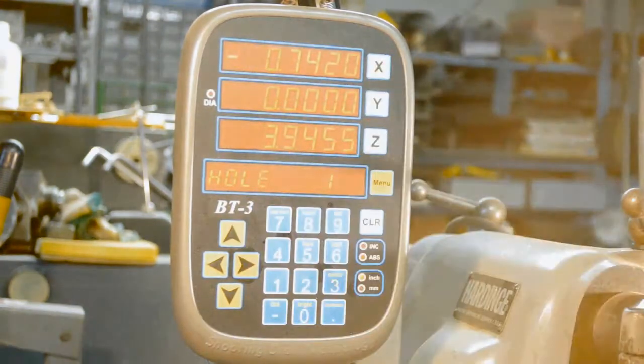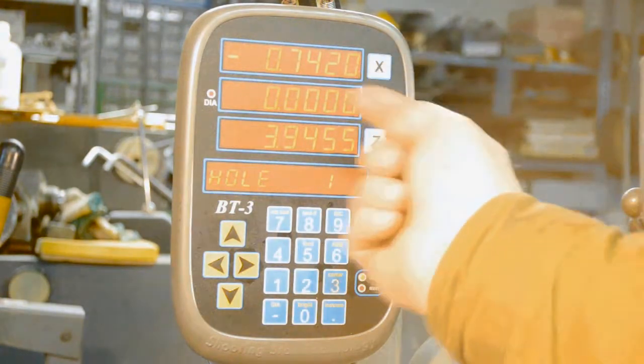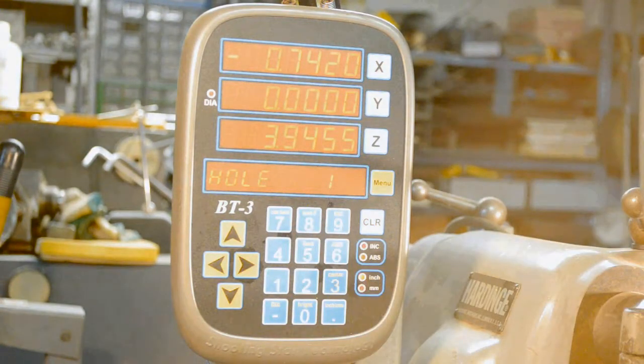And it comes up with the first move I've got to make to wind up where I want to be on the wheel. I think in an earlier video I said I might write up a CNC program, and you know, you stop and think for a while and say, wait a minute, the Shooting Star is going to be much easier to do. So I'll run you down and watch you. Each time I push the right arrow again, I'll get 2 new numbers in the X and the Y, and all I do is go to those numbers and pop the hole in.